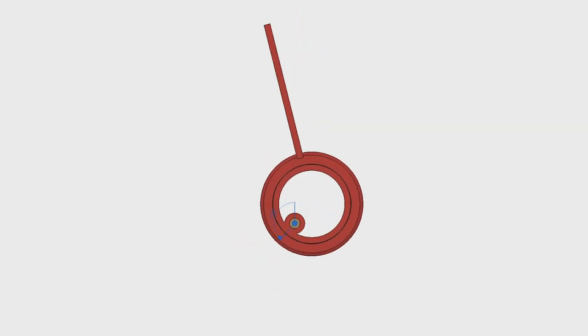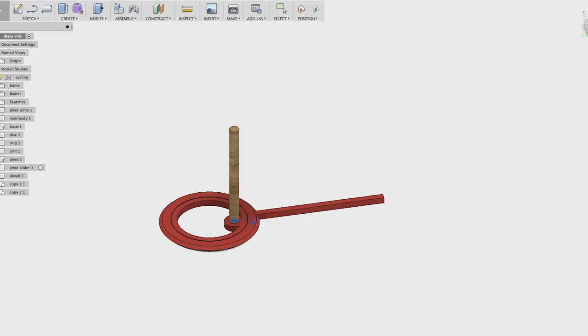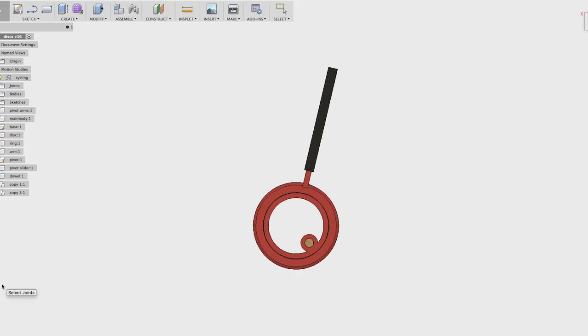So instead I'm going to use movement 89 — as we turn the disc in the middle, that will move the arm back and forth and up and down. The only problem is that out-and-back motion, because I don't want the feathers moving up and down, I just want them going left and right. So I'm going to have another holder for the feather that works as a sleeve for that arm, and as it goes up and down it'll just move inside the sleeve, and only the left-and-right motion will move the feather.